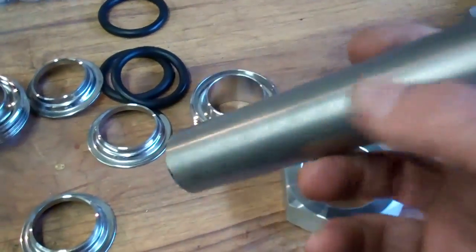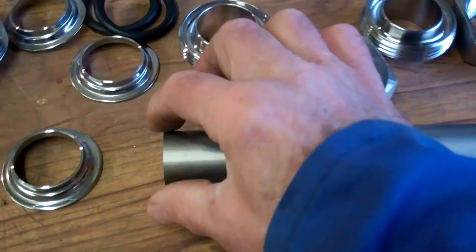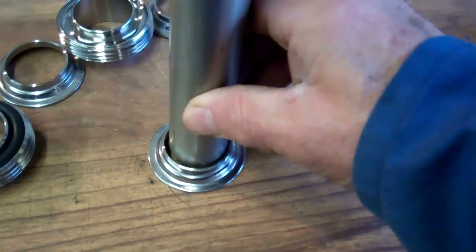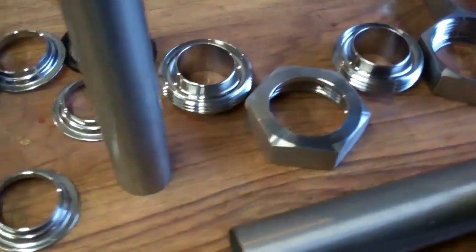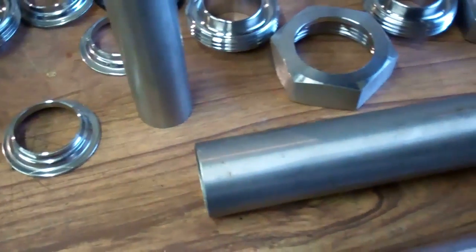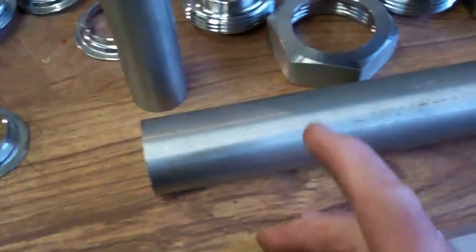One size of tube needs to be 32mm OD to slip the flexible pipe onto, so the 32mm tube has got to be flared out so that it lines up with the fitting. The other size of tube he needs is 40mm, so the 40mm has got to be reduced in size to line up with the fitting. The pieces he needs welding on the fittings only need to be about 80mm long.